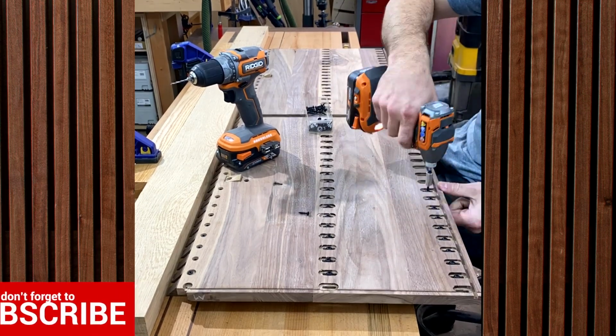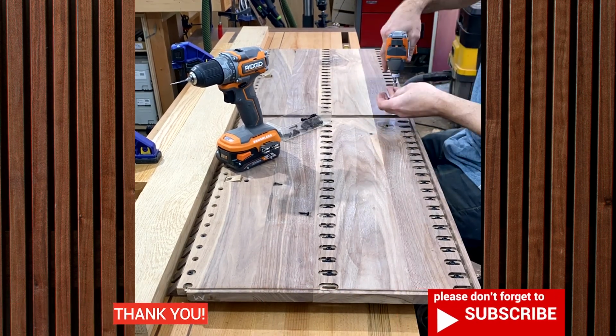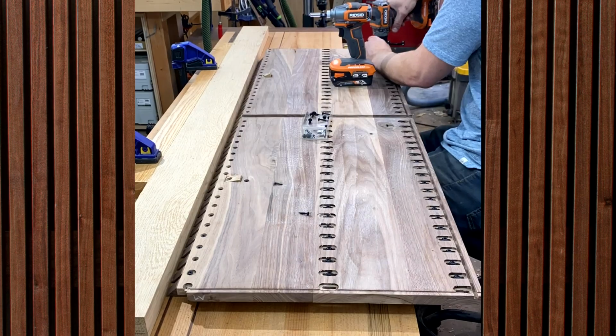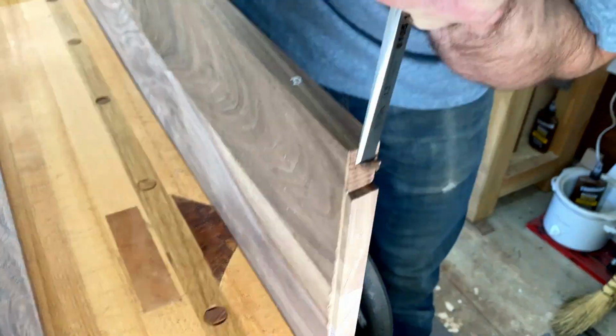And then all of the drawer fronts are the same way, so they've got 3 anchor points as well. You can see those slots allow for the movement. The anchor point up front keeps it in place and maintains the gap. And yeah, overall, super overly complicated and just my style.